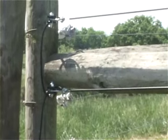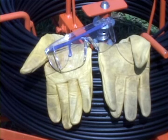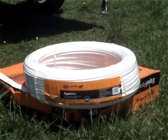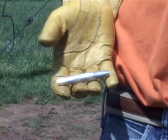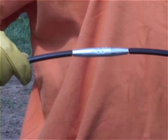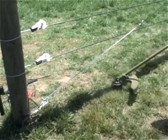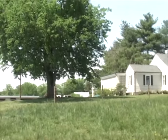In order to connect power to your Equifence system, please refer to the installing the energizer section of this video. Be careful when running wire — when loose, always secure sharp wire ends in the ground to avoid injury, and wear safe work gloves and goggles. In addition to electric black, Equifence is also available in electric white, non-electric black, and non-electric white. In order to join two separate pieces of Equifence, use an Equifence wire joiner: strip back an inch and a half on both sides, insert wire into one end of the joiner, and repeat on the other side. Always keep weeds and grass off of your electric Equifence, as they can ground out your wire and lower the charge. Occasionally check the tension. This concludes the Equifence portion of this video.